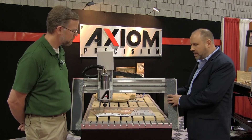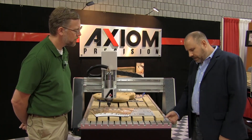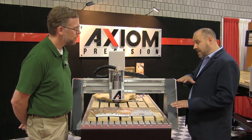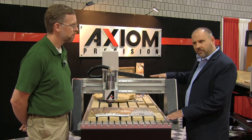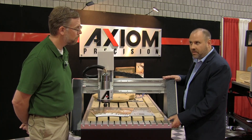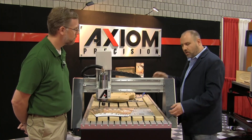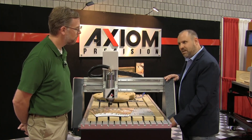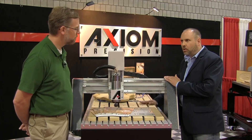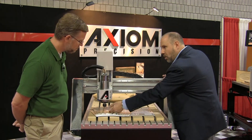Massive gravity castings on the gantry legs. The table is kind of unique in how we've pulled this all together. Instead of building a steel frame and securing our guides to the side of the frame with a table independently mounted on that frame, we've actually mounted our prismatic guides on a massive 40 millimeter thick aluminum table. That gives us a much more rigid table than most in the industry, and it also ensures that since the guides are mounted to the table, when the loads on the table change — a down spiral bit versus up spiral — when this table moves, our gantry is tied directly to it, not independent of it. So this distance always stays the same.